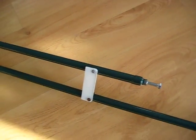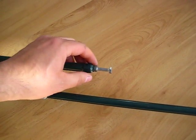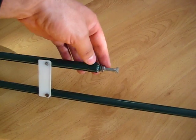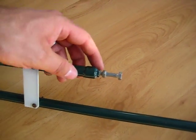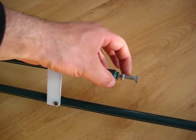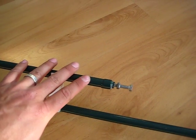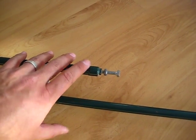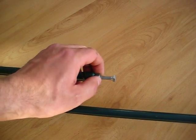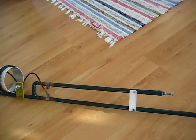What's interesting about this tuning stub — I placed on the upper end a bolt and two nuts, where one nut is soldered on the upper end of the tube. By turning the bolt I can adjust precisely the length of the tuning stub and fine tune the antenna. Right now I have a standing wave ratio of 1.2 to 1, so I think that's pretty good.